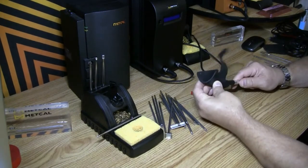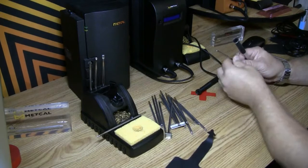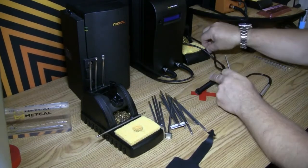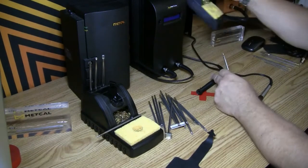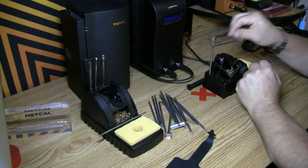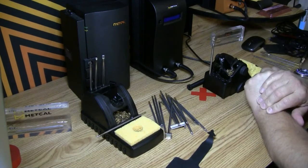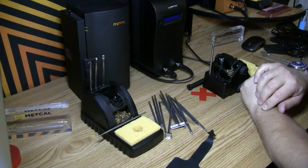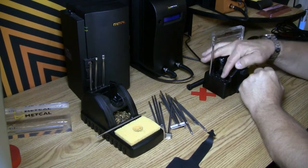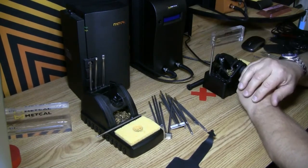Now this is a silicon tip pad that I'm using because I don't have fingers of steel. One of the things I didn't mention before — in our iron stands, all of our new iron stands have the ability to store multiple tips. In this particular version you can store five in the back and another six in the front, so that's 11 cartridges altogether.